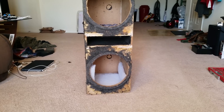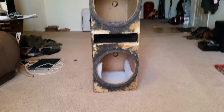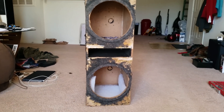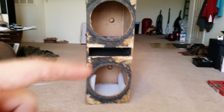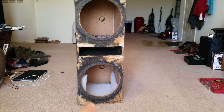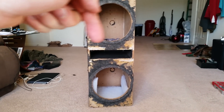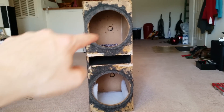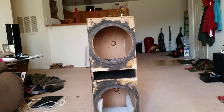A quick note about my setup: I didn't want to buy a single subwoofer box, so I'm using my double box — designed for two twelves — with only one subwoofer. I'm placing my subwoofer in the bottom slot and blocking off the second port so all the airflow cycles through the vented portion. Even though it looks rough right now, it'll look much better once I re-carpet it.